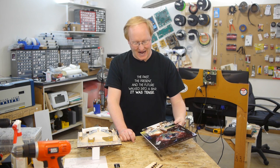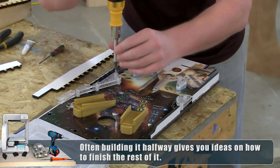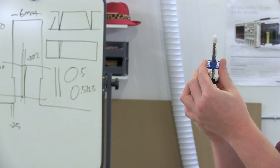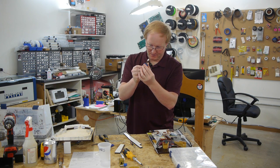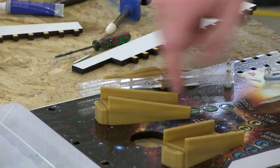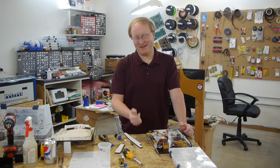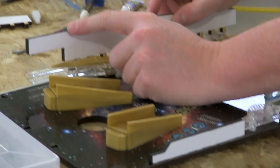We have the new playfield ready to rock. I'm going to move some of the parts over from our test playfield onto this one — let's move these ramps first. There are still a few things in this pinball that are in a state of flux, but we can get as far as we can with what we have. I assembled this miniature plunger — it has three 3D printed parts. There's a NinjaFlex flexible tip, a middle plate which will attach to the case, and a black handle that you pull back. It will shoot the ball up this little ramp and the ball goes over it and down into the playfield, so the orbits are kept intact. My only concern is we don't really know how hard this will hit the ball — it might hit it too hard. If that's the case, we'll put some sort of curve up here like a backstop to guide it back down. We won't really know until we build it.